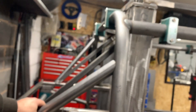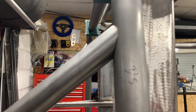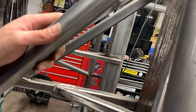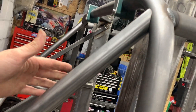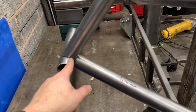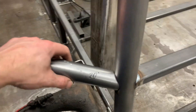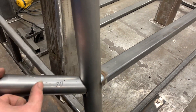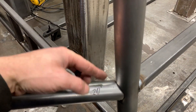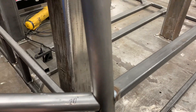With this one you notch your top to whatever angle you desire. I've seen some where it's down here, so you'd be at even less of an angle. Because I put mine on the corner it just happens to be that angle. As long as you use how we did these ones in the earlier video - you just put the tube where you want it, dot where it touches, dot where it touches, join them up. That's the same on pretty much all the notches. You take a reading, but you've got to know where it's got to be, so you put the tube where you want it and you touch it where it touches the main tube. Pull a line on the end and a line on the other end - that's where you're going.